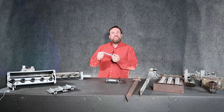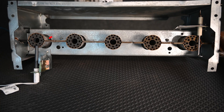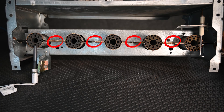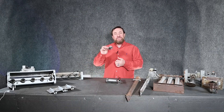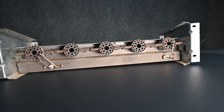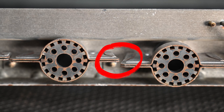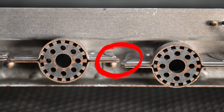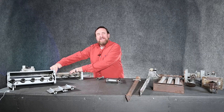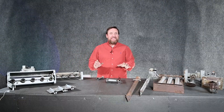On the sides we have these crossover tubes. On these in-shot burners there's a little bit of extra metal on the side that carries the flame to the next burner, and the next, and the next. On modern furnaces with in-shot burners we have the flame sensor on the opposite side of where we ignite so that we know flames have carried all the way across. If these get out of adjustment and don't line up, it won't properly carry that flame and you'll end up with a flame rollout.